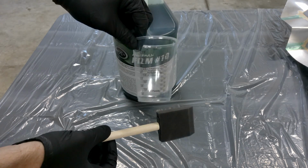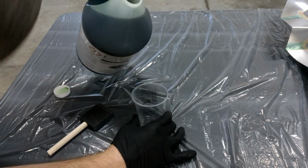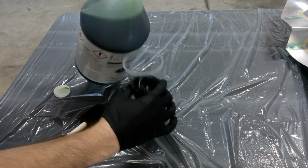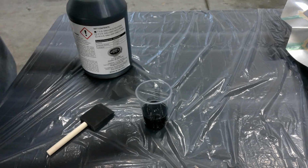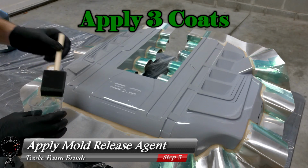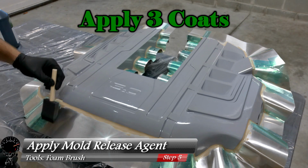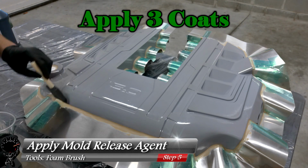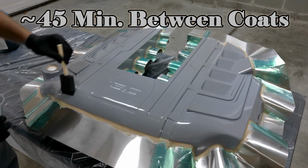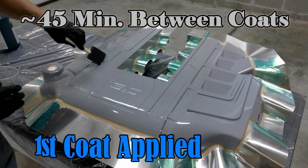You can go ahead and use a spray gun, which we'll do in the next video, or you can go ahead and use a paper towel. But for now, I'm just gonna show a very easy way, just using a foam brush. So I'm gonna put a very little amount in a cup, and then we'll go ahead and apply very thin coats to our plug and our flange. And you want to make this very, very thin, so if you see any air bubbles, just keep brushing it out. You want it as thin as possible. And we're going to do this 3 times, waiting 45 minutes between coats.